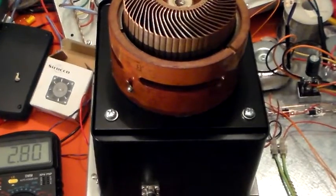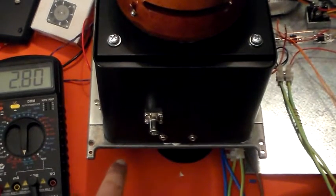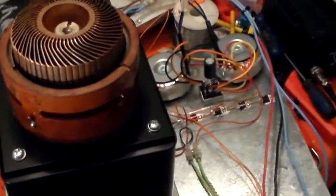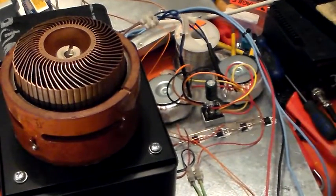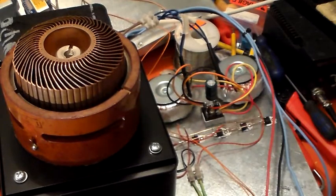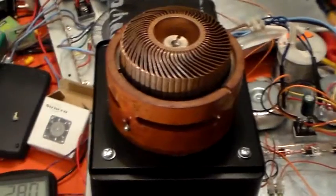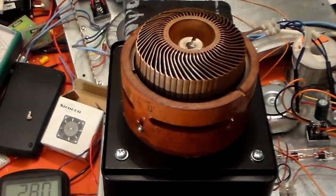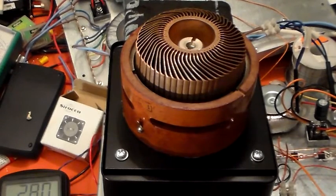What's going in the box below that — what's going in the box that's going in here — is those two transformers here, these two toroidal transformers. They're forming the DC supply for the fans. I didn't want to use DC fans but I couldn't get AC fans that would push against the static pressure, so DC fans I have.